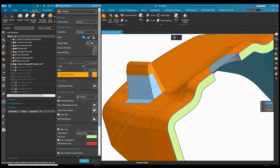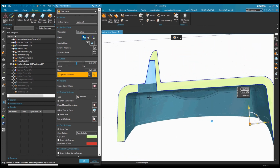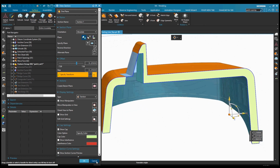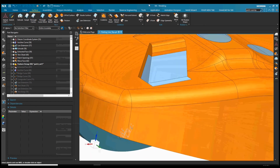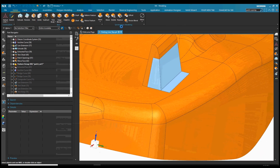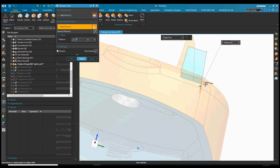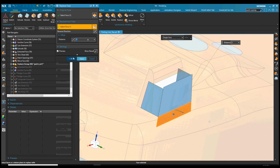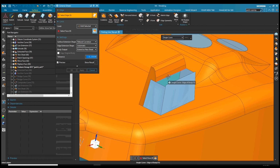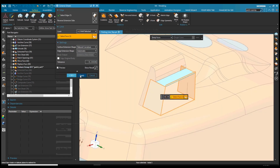And it's already looking kind of tall and thin, and you can see, yes, it'd be kind of tall, hard to get a cutter down. You wouldn't have radii on the sides. So we can alter this as well. If you're not staying exactly within the Mold Wizard tools, you can come out here and do some synchronous commands. We can replace this face and adjust this surface quite easily. Now for the top face here, we can just extend that under lip face there and bring it out to the edge of the seal off.